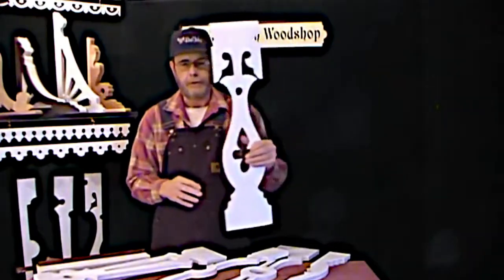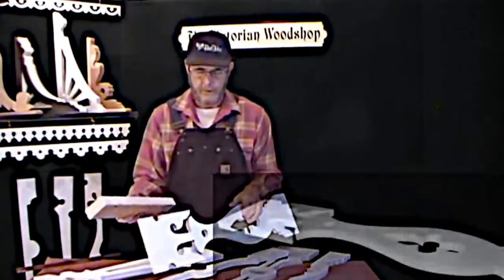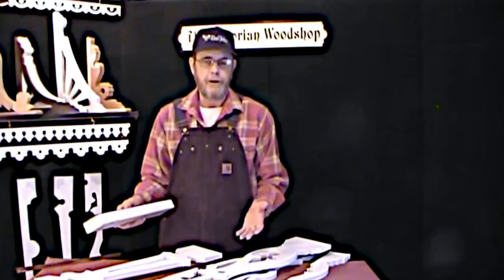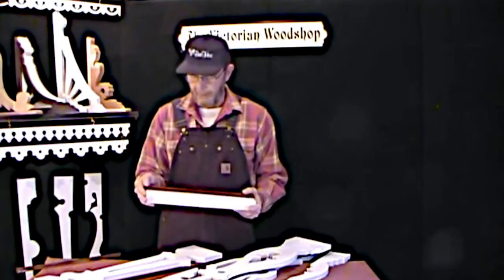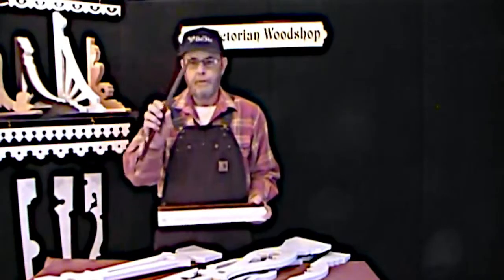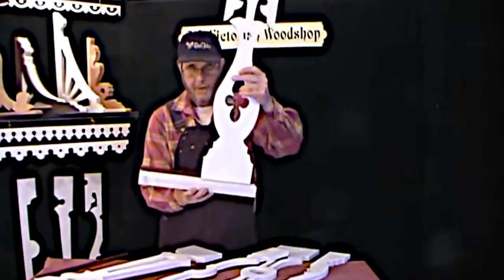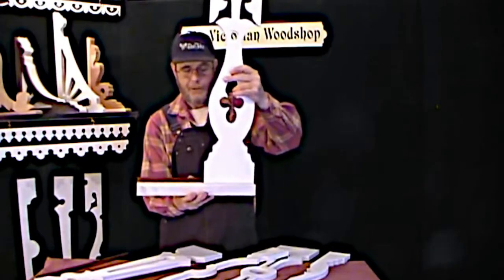While we're talking about railing systems, here's one that I really like and it's easy for you to do. You may not have the ability to route a groove in a long — say a ten-foot — piece of board, or your local home center may not sell them all, though do check because a lot of them do. A real simple way to do it is to just take a two-by-four — I brought a little example up — cut it ten feet long, and just take a strip of molding that you can pick up anywhere. Glue it, nail it to your board, and then you can just take your balusters and slide them in like that. You're making your own groove.